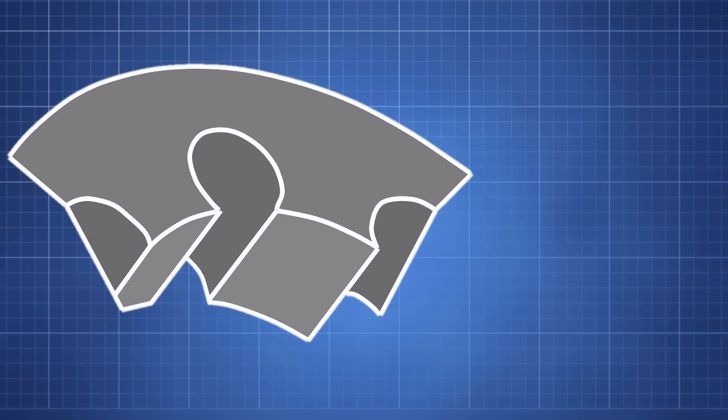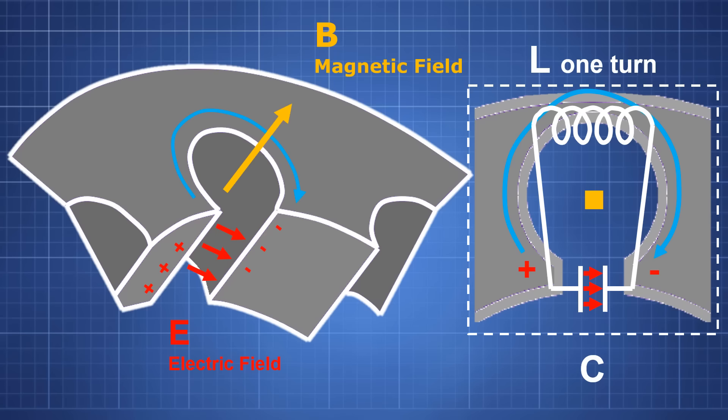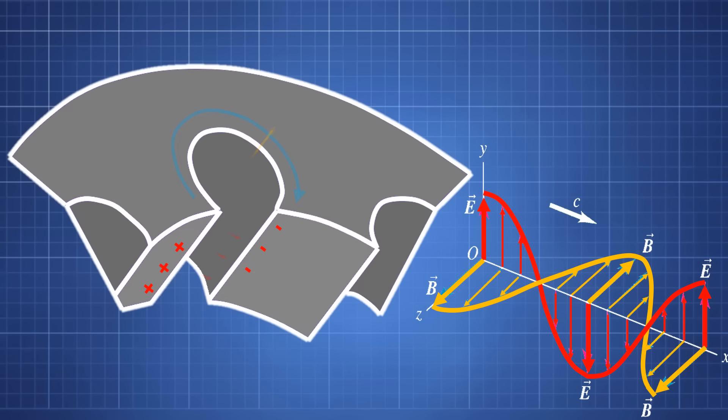Why the electrons do this is a lengthy explanation and out of the scope of this video, so I'll leave some links in the description for your own study. Now let's take a closer look at one of these resonating cavities. We see that across this resonating cavity, the base of it where the charge separation is kind of looks like a capacitor. And that loop going around the circle kind of looks like an inductor with one turn. So let's model it as such and see what happens. This capacitor portion at the bottom creates a constant electric field across it thanks to the charge separation. And the one-turn inductor will create a magnetic field going in and out of the plane of that circle thanks to the rotating current around it — essentially it's a really weak electromagnet. So what we see is that the electric and magnetic fields are perpendicular to each other, and it's electromagnetic radiation, as evident by the alternating electric and magnetic fields that are perpendicular to one another.